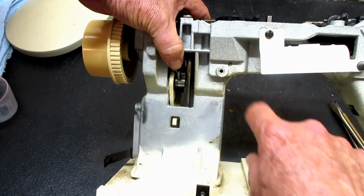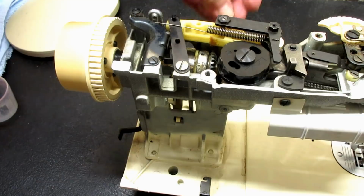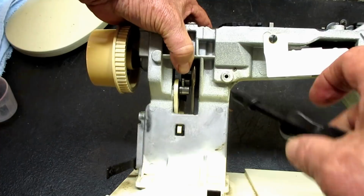right there. Now on some of these machines where the cam stack has been towards the front, there'll be a set screw like that in the front. In this case, it's in the back, and it's a little guy. I was surprised when I saw it, how little it was. This is a number 38 bit. So I'm going to go in here